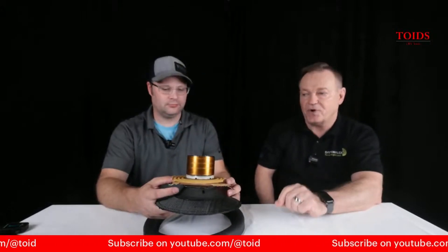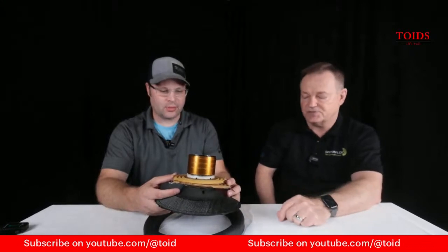If you have a spacer in between the two spiders, that's really important for large excursion drivers. When we're talking about linearity, we're talking about linearity going up and back in. You want linearity because if not, that's when you hear things scraping — when you push the driver too hard, mostly in this case a subwoofer.